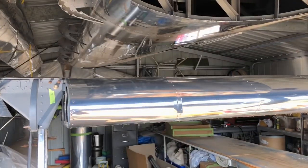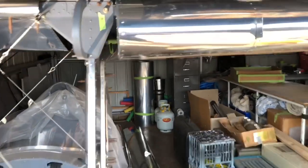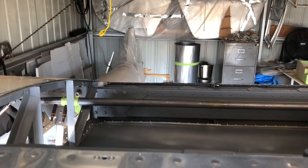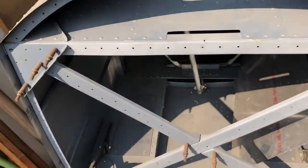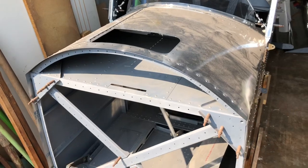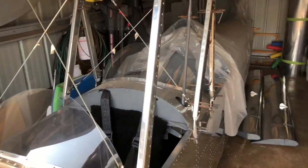I've still got to make wing tips and leading edge slats. For the fuel system, the tank will go in this bit here. I'm still tossing up whether to have two tanks feeding the engine or have a third tank — like a header tank down in here, maybe 20 to 30 litres — as a header tank. That gets me my four hours range and a few other little things, so we'll think a bit more about that.